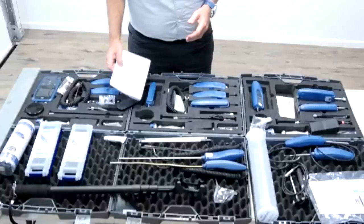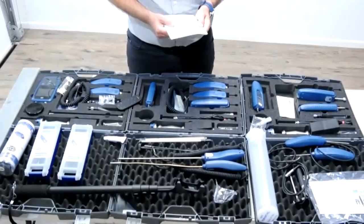If drying has been successful all over the place, or if there are still some differences, some spots you will have to check separately. So that's the relative scale, and you also have the possibility to choose different settings for specific building materials if you need to have an information in percentage. So you have different settings. Let's run through some of the settings.